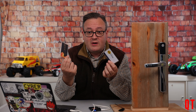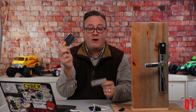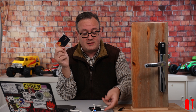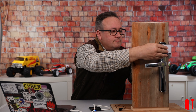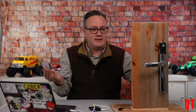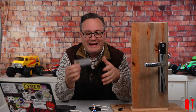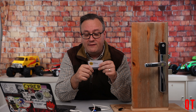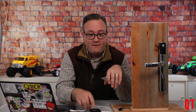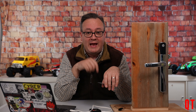I'll show you how to copy that block back onto the other card and demonstrate it working. I've already copied this card last night for some other reason, and if I try and make this work it won't — as you can hear it says 'invalid card'. Whereas if I do it with the original card, there we are, it actually works. As I put this card on it rewrote a unique value onto block number five.